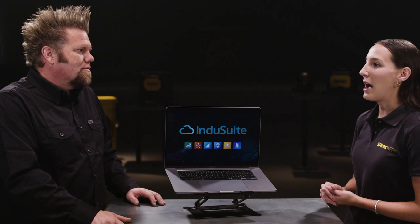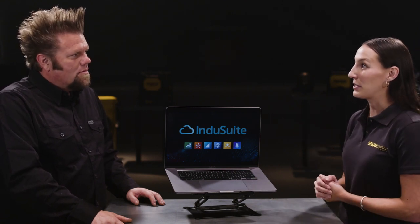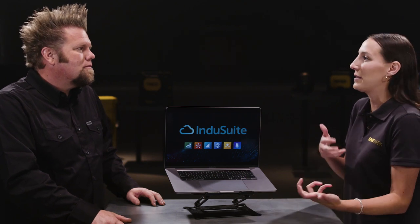So when you say offline programming, do you mean I can basically create a sample of the weld and run it virtually before I put it into the machine? Absolutely. No matter what robot you're working with, whether it's a KUKA or FANUC or any of them, it spits out the exact code that it needs and you upload it with a USB stick right to the robot. So instead of using a teach pendant, you use your computer.